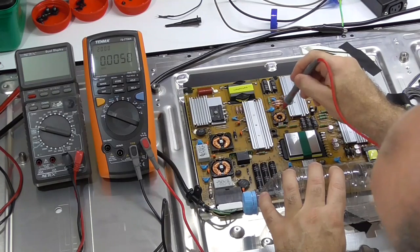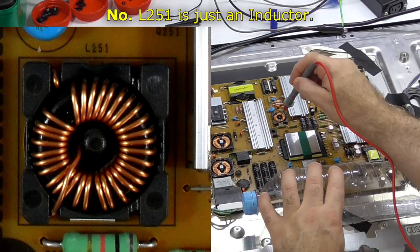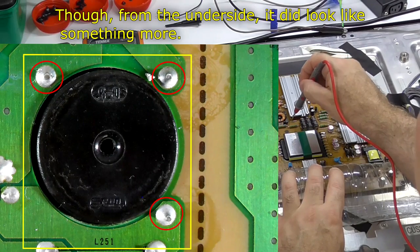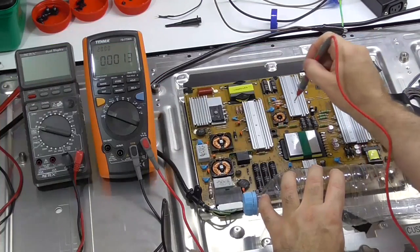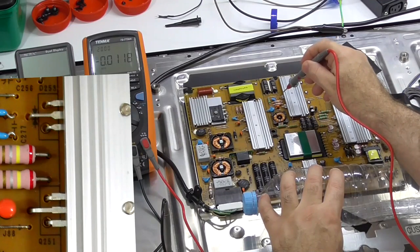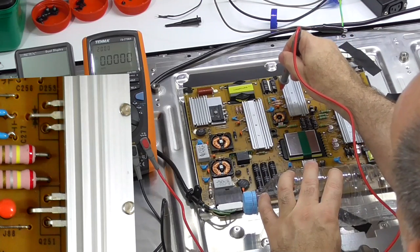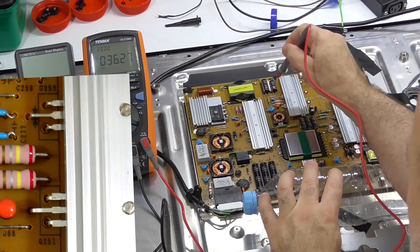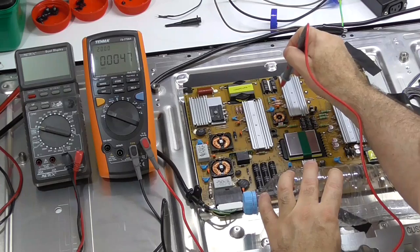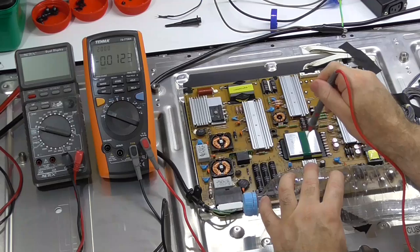And I haven't quite figured this one out. I think it's a center tapped coil. Not completely certain on it. I have to trace the circuit out. This is earth. And this is a MOSFET here, and that's a diode. And it's a common cathode, I believe, which has to be 36 volts there, yes. And these are the capacitors, filter capacitors for those, yes. And that's being fed from the secondary of this guy.